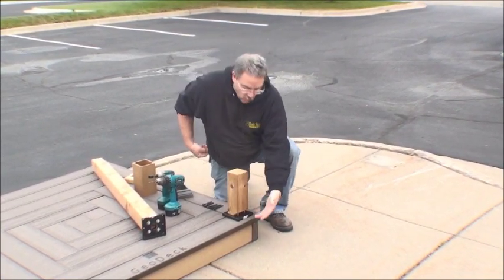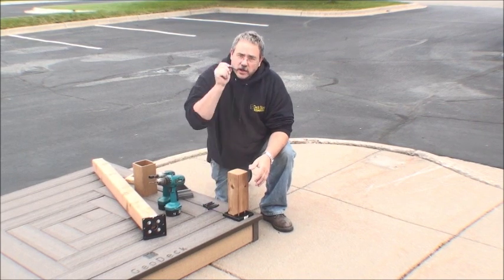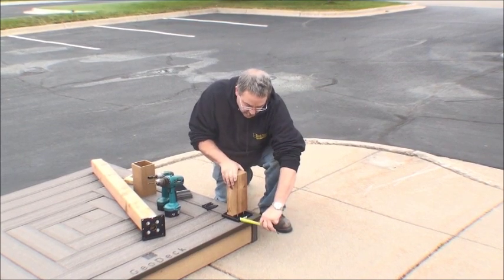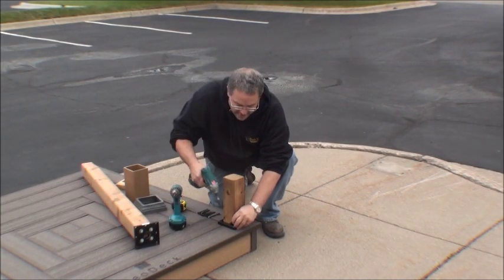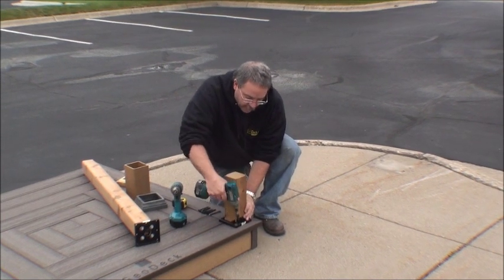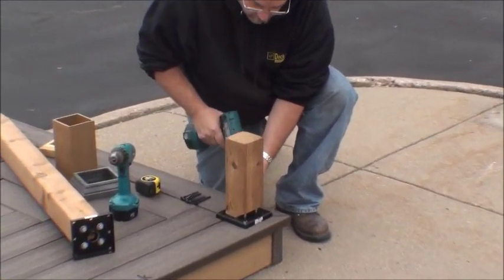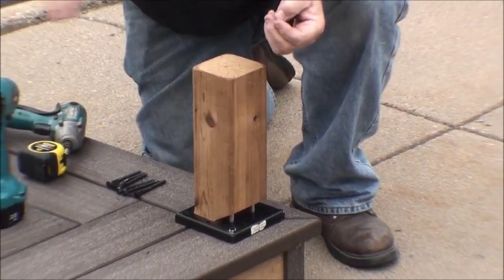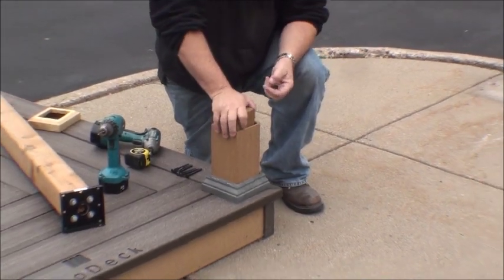We also want to pay attention to what's underneath where we're going to apply this. We need adequate blocking or structure to attach the bolts to. So once we've determined that, and we've measured it, and we've determined that it's straight and that it's square to the deck surface, we're ready to apply. Take the supplied Titan anchors, apply them as needed around the perimeter, total of 8, and you want to use all 8 of these connectors. Now I like to pre-drill the holes so there's no chance of splitting the decking and that type of structure. Once we get all of the bolts properly attached, we're ready to place our post sleeve over the top, our post skirting over the top of that, and complete our rail system. It's easy as that.